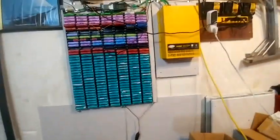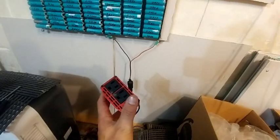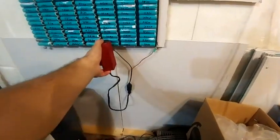You can't use this configuration with this BMS unless you unplug that little plug while you're using the 3S. But when you plug it back in, it'll see an imbalance and be upset. It works — I ran this one and that one at the same time for a little bit, but as soon as this one brought these batteries down more than the rest, the big one turned off.